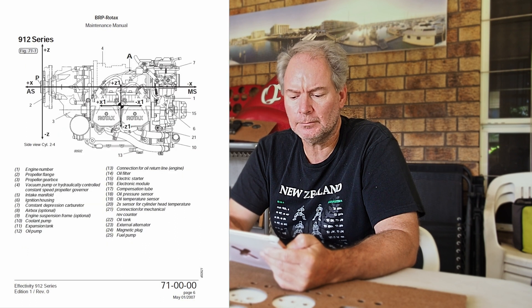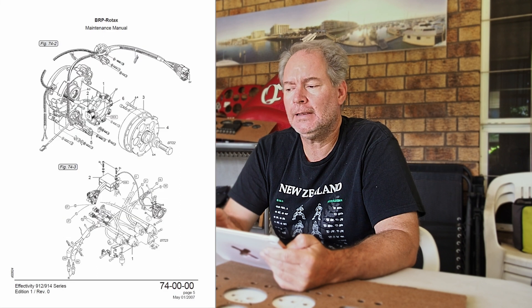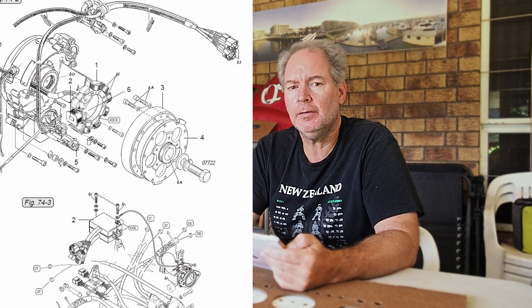Can we start the engine without a propeller? From what I understand, yes. The generator has a form of flywheel, so that's not the problem. But without a propeller there's nothing to restrict engine RPM, so it can easily run up to high RPM very quickly. The plan is to go very easy on the throttle, not over-rev the engine, keep it at idle, warm it up, and see how it runs. I haven't found anything from Rotax that says you can't start the engine without a propeller.